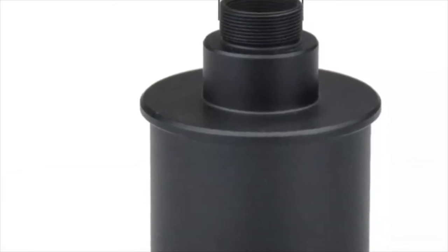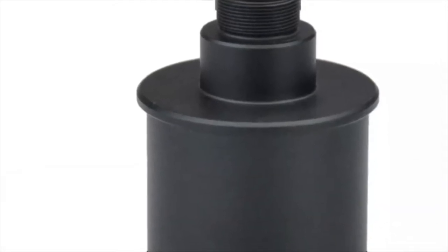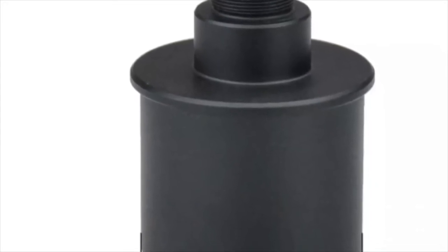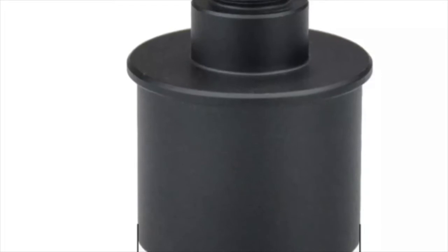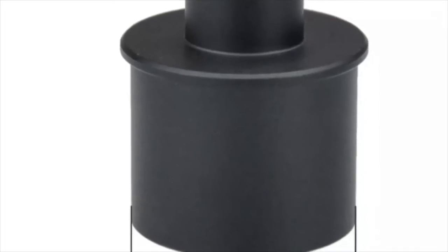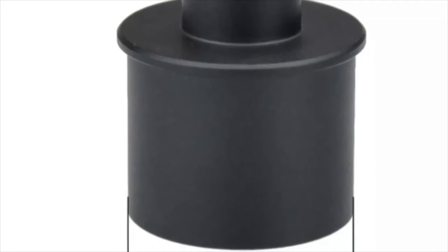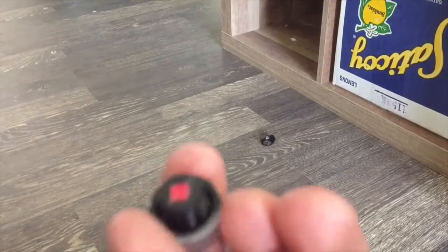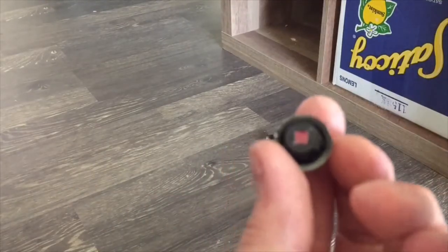Totally ignore any recommendations about gluing on old film canisters and that sort of thing. When I tell you it's extremely important that the webcam sensor is flat with the image plane, trust me on that. The third consideration was filter position, and what I mean by that is this IR cutoff filter.